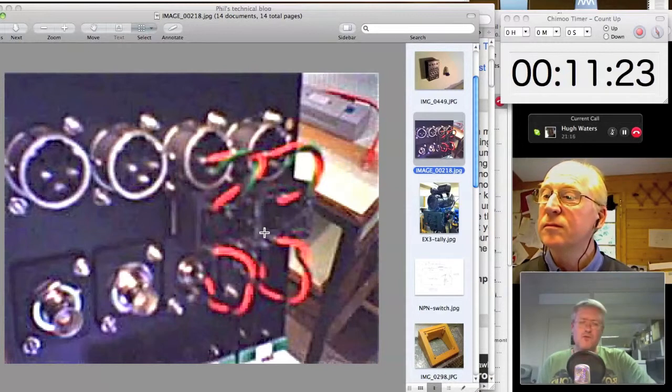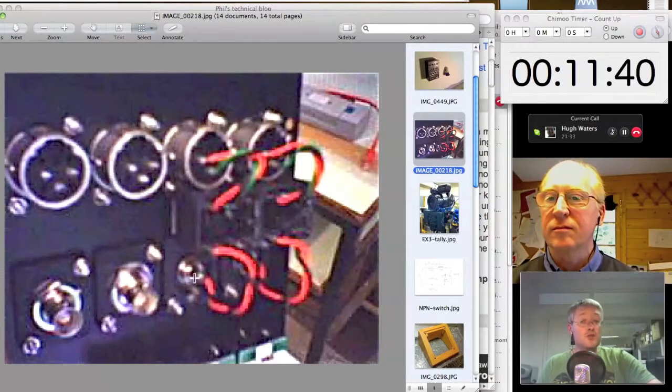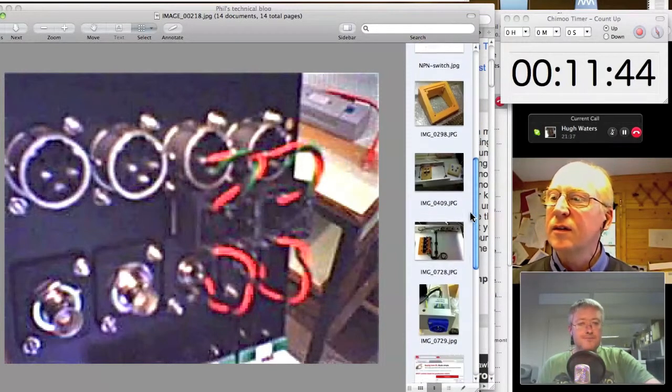And so rather than having balancing boxes strapped to the cable tray on the back of the desk, I often stick a couple of rep coils, a couple of unbalancing coils in the back of the wall box. So that whatever's being fed down those tie lines off the matrix, off the jack field, directly from the Avid or whatever, there's also an unbalanced version of it as well. And that's often a very handy addition to an edit suite. Oh, that's a great idea.